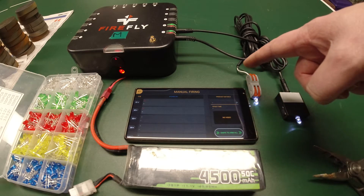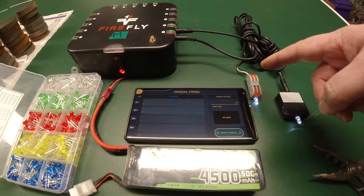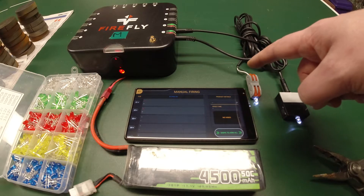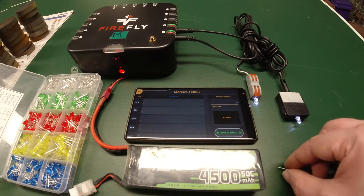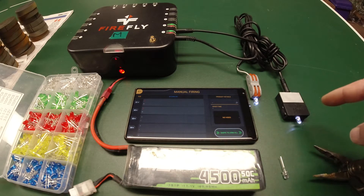So in my cases, if you've stripped the Firefly cables, the not-black wire is positive — so on my cables, they're white. I've seen other Firefly cables use red and black, so red is positive. So the long leg of the LED goes to the positive wire. And same with the Titan clips — you'd have to use a multimeter to check the pads to see which one is positive.